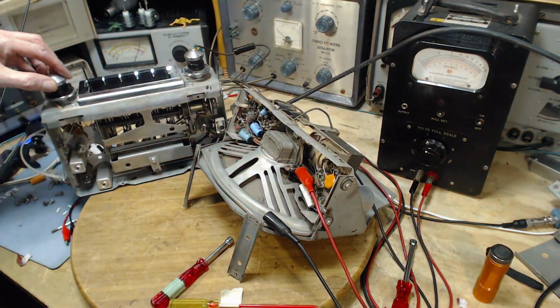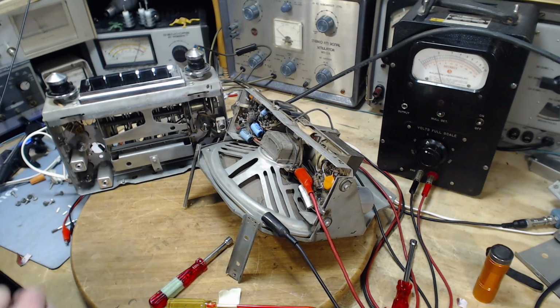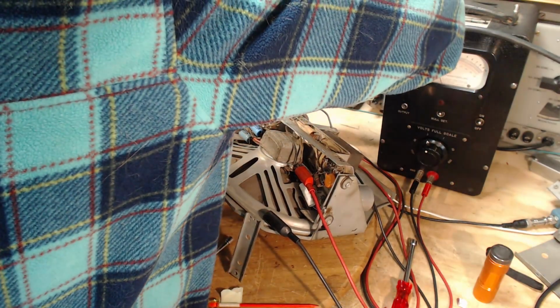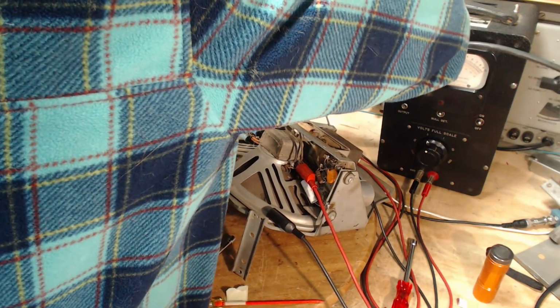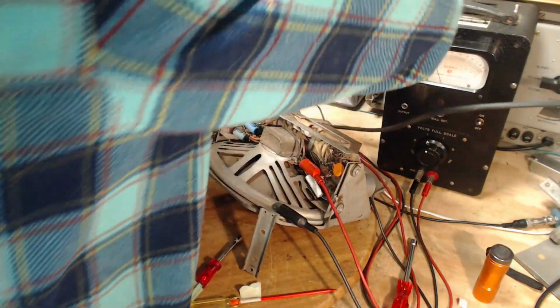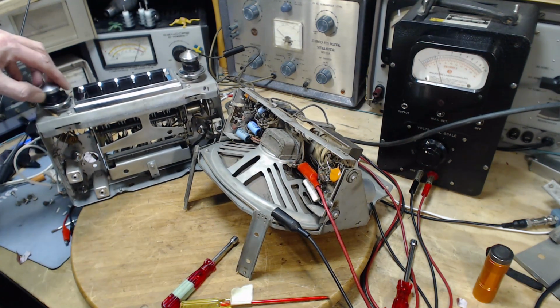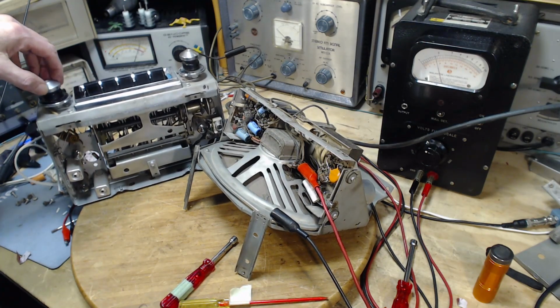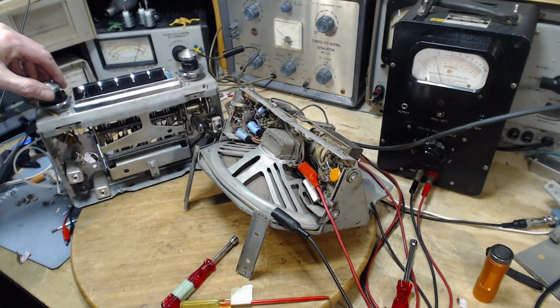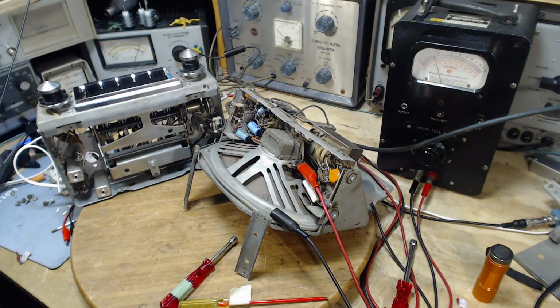Okay. Piles of volume. Very good. I'll be able to let this run. I don't think we want the antenna in during this first adjustment. Oh my gosh. There. During the first adjustment, we don't need the antenna connection, and it just causes a problem. That's the radio with no antenna. Good show. This is probably reflecting the buzz sound that we're hearing right now. Okay, I'll let everything sit and warm up for a little bit, and we'll go ahead.